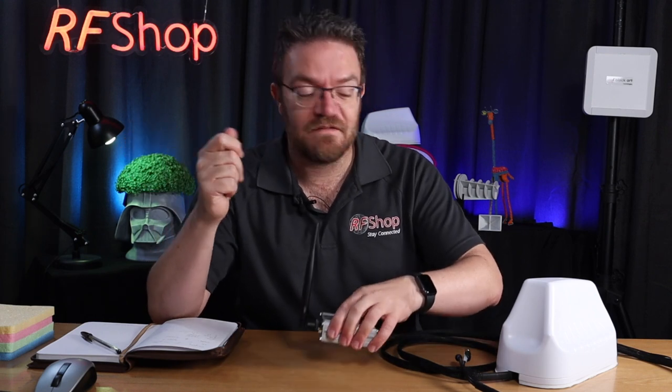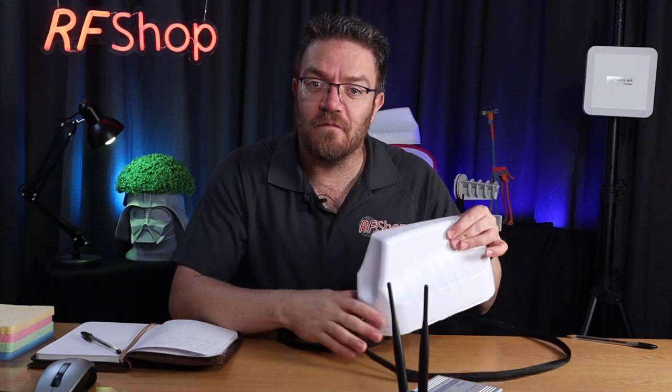Now, what's the problem with going too fancy on the numbers? It's all physics. We're working within the same form factor — the same little box. If you put two antennas in there, they each have space to work. If you condense four antennas into the same space, each has a little less room to do its job properly. We call it cross-coupling between the antennas. The dash-15 adds another element, and the dash-17 adds two more on top of that.